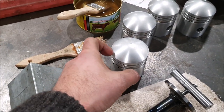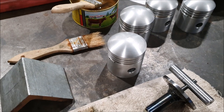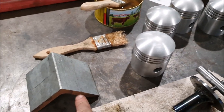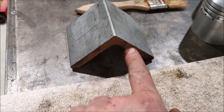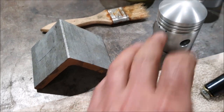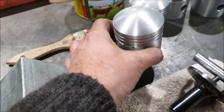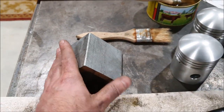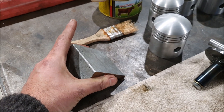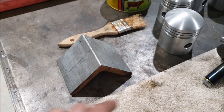I'm probably going to use the fly cutter to machine this down, so it's a very very light cut — there's not going to be a lot of movement on it. I think this angle iron is thick enough that the bolt's not going to move if this is all pulled down. I'll probably go with this mainly because then I can get a very firm grip on it in the milling vice on the sides of it once I machine those square. That'll be tomorrow's job.